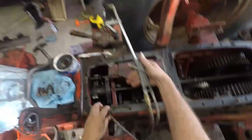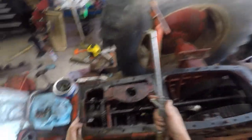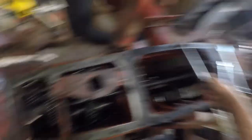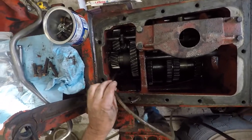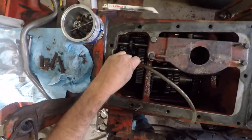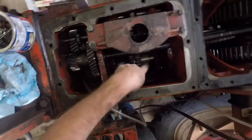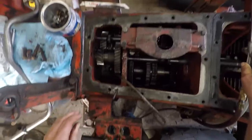I've taken my old engine cleaner device — it normally sucks up fluids, but I'm using it backwards, blowing bubbles down there to stir up all that nasty snot I'm trying to clean out. I plug the end by jamming it into a bolt hole. It's bubbling and boiling, hopefully knocking out some of that stuff. I got the first compartment mostly clean and drained it off into a pan to see what kind of nasty goo comes out — and a big old chunk of junk came out of there.